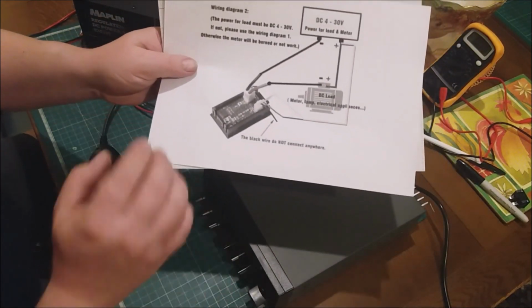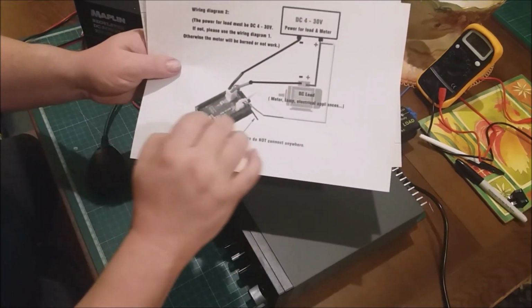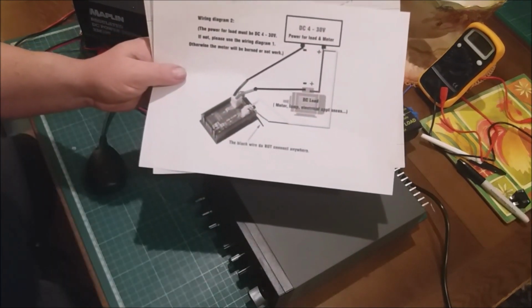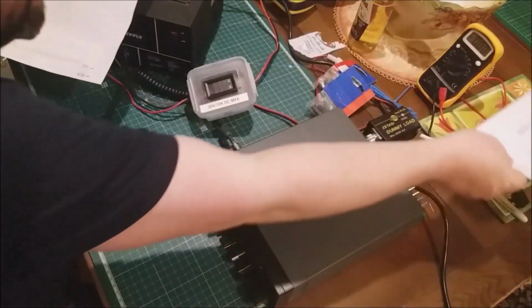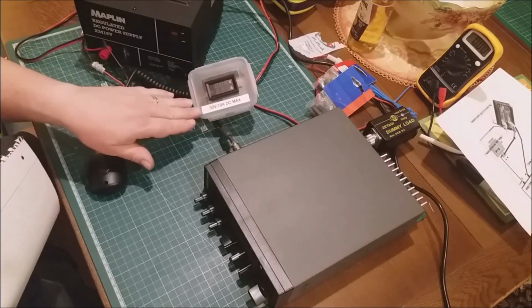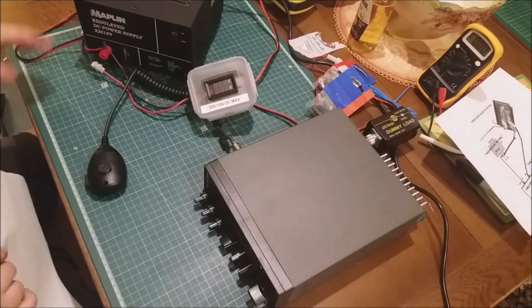So as I say many times in this video before, I've included fusible links in here, 50 milliamps, and here 10 amps, so we don't exceed the rating of the meter. So I say this is up to 10 amps maximum, okay. Any more than that, you'll have to get the version that includes the shunt. All right.